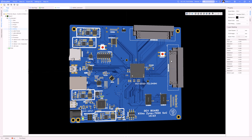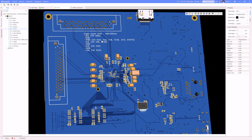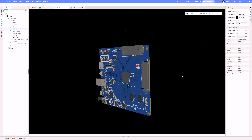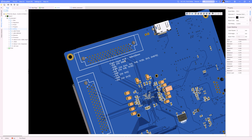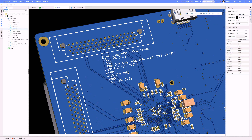The way the board sits today, I haven't ordered any PCBs, but I've been versioning this — I'm up to version 0.03. This is an 8-layer PCB, 158 by 135 millimeters. I was hoping to get it into 100 by 100 millimeters, but that was just too much to pack in at my level of skill routing these kinds of boards. I considered a 10-layer board, but that would have doubled the price. Going larger only increased the price by about 15%, so that's where I ended up.